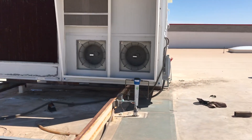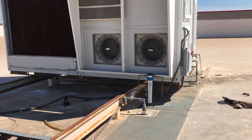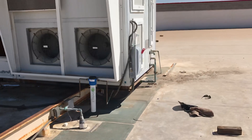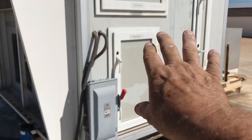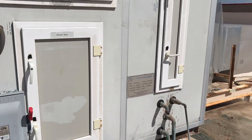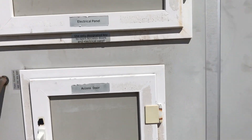The system is running as it's designed. Now these two fans right here put out about 25,000 CFM, so that's a lot of air being blown through this system. Inside right here is the supply fan side, and that warm air is being brought in and blown over the face of a coil. In between this door and that door, there's a coil right here, and I'll show you that door.